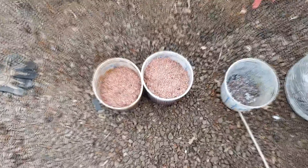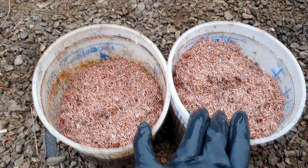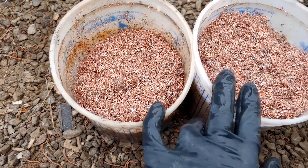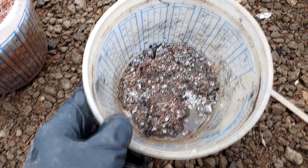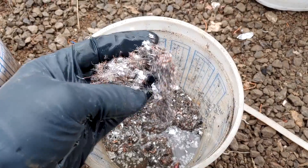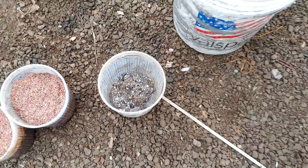Here's a look at what we ended up with. This is our number one concentrates — pretty much pure copper. I think this would easily be classified as number two copper because it's got the tinned wire in there and the finer wire size. Just every once in a while there's a little flake of aluminum, but that's well within spec for number two copper. Here is all that we caught in our number two concentrates: some aluminum, a little bit of copper, mostly tinned stuff, real fine stuff — it kind of rats-nests up and wads up. But there's hardly anything there, and you'd probably just throw that back in the granulator, chop it up, and run it back on the table.